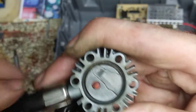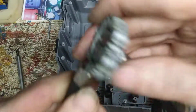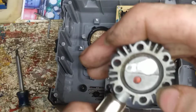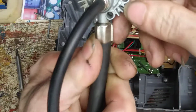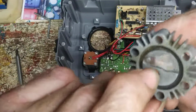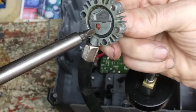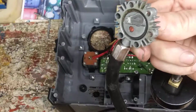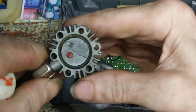See, this lets the air... How is that? It does something with the air. This one actually seems like it's the opposite. And then it's got this little rubber piece. Oh, that's going to let the pressure up in, but not let it back. This rubber is going to set, it'll let air up through, and it's spring loaded. So when the pressure backs off, it holds the pressure so you can at least read it on your gauge. That's the way that works.